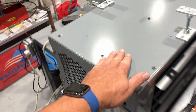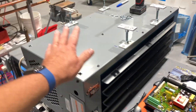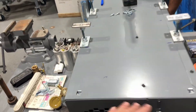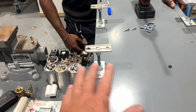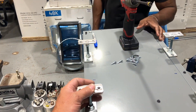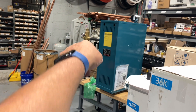Tyreek and I have been working on this Modine hot dog — Modine is also a sponsor. We're getting creative and thinking outside the box. We noticed there are 3/8 threaded rod connections on all sides except the rear and front of this hot dog. This is their hydronic version as opposed to the gas version. We modified it slightly — probably not approved — but it's only for lab testing. We used some 3/8 plates and made some stilts to put this Modine on top of the US Boiler X2, and we'll screw them down. We want to access the supply, return, hot water in and out, and connect it to our zoning off the boiler.